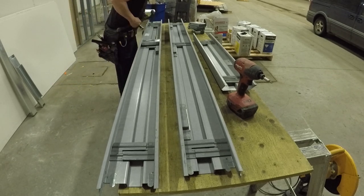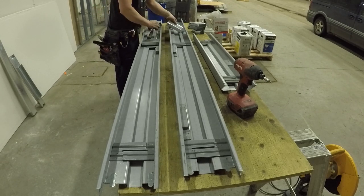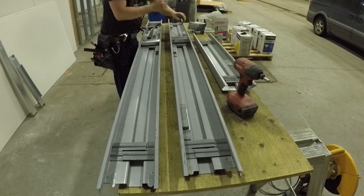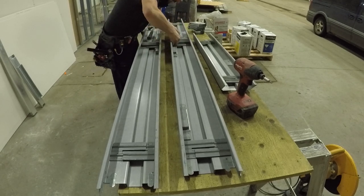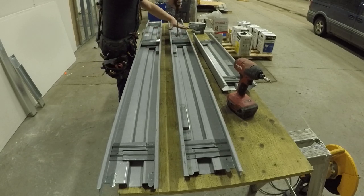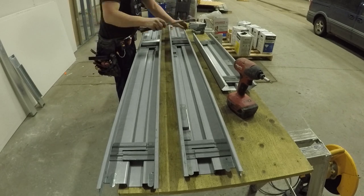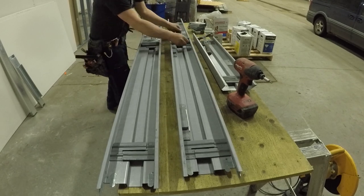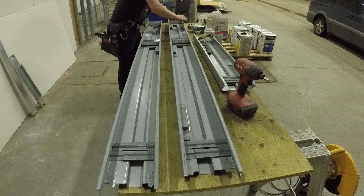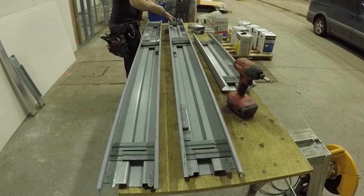And then I'll put the heavy gauge wafer in, the sliders there and the track there so that the door stays perfectly at 4 7/8 all the way down for the opening. Yeah, you got to put the middles in. Sometimes they'll slip in if you open the frame all the way. But generally, I just put them in at the top and the bottom. They'll slip over. But you don't want to hammer them in all the way yet, because you want to be able to get that heavy gauge wafer in there to keep them from moving, right?